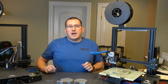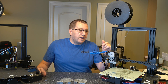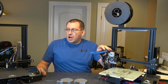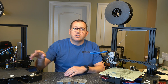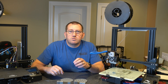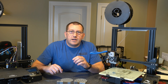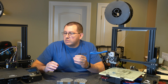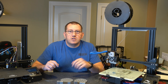I did want to note that the printer I have set up here has an all-metal hot end and a direct drive conversion kit, which made things easier. I was able to get some prints with my standard Ender 3 Pro — basically stock minus the BL touch — but with the Bowden drive system it was much more difficult because the jam and resistance issues are multiplied due to the length of the tube. You can get away with a Bowden system, it just will cause you more headaches. A direct drive system is going to be much easier.